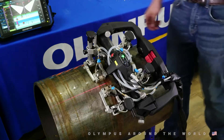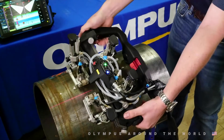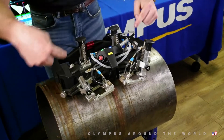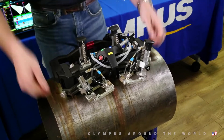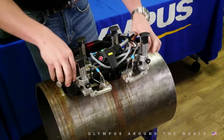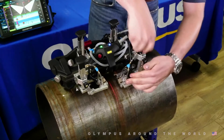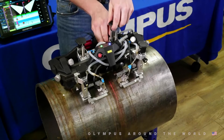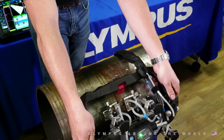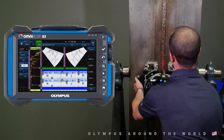Let's have a look at the seamless transition from longitudinal to circumferential scanning, as we discussed earlier. First, we'll lock the probes in the upwards position, lift the scanner off the part, and set it down in the circ position. We'll lock the brake to hold it in place. We've only got two frame adjustments to make — we'll loosen the thumb screws, pop them up to the top position on the front and back, and lock it up. Now we can release our probes, release the brake, and after those simple steps — without the use of any tools or additional parts — we're ready to start scanning in the circumferential direction. For large diameter vessels, tanks, and flat plate applications, the Axiom scanner is still a great semi-automated weld inspection solution.